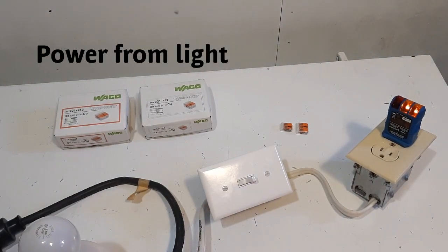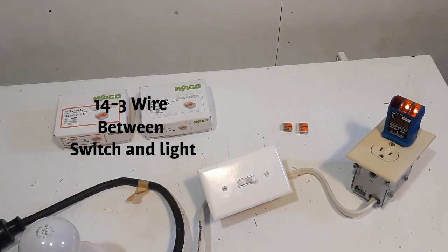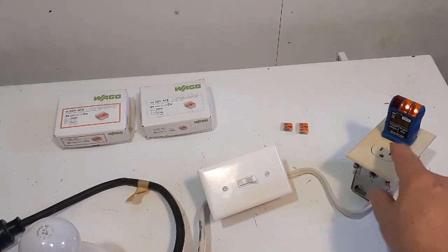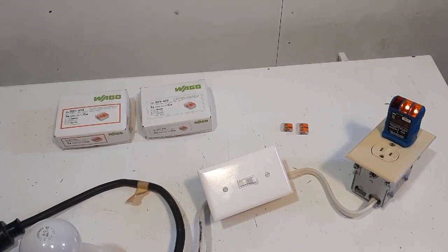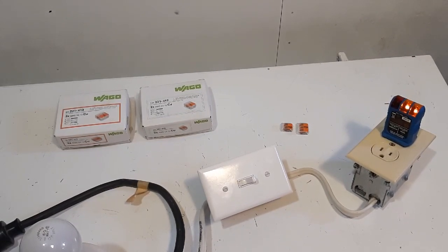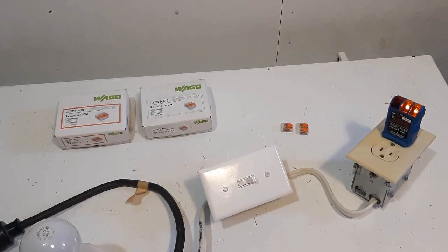So again, we use three wires coming into the light. Power comes into the light first. We use three wires going into the switch. We jumper those wires — a bit of black and white going to the receptacle. The red returns to the gold screw on the light, completing the circuit. I'd like to thank my subscriber who mentioned how to wire this properly — he wants to remain anonymous. Thanks again. I'd like to thank all my subscribers, all my new subscribers — thanks so much for subscribing. If you've watched for the first time today, please subscribe to my channel. Thanks for taking the time to watch the video today. Have a great day.